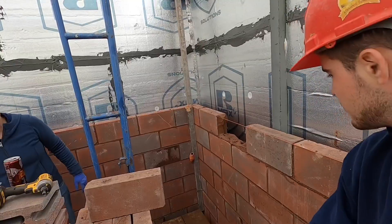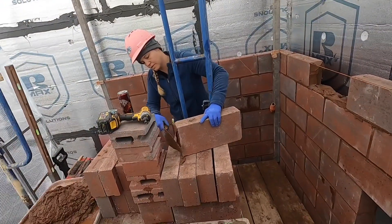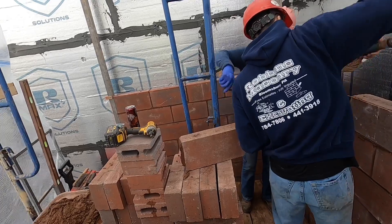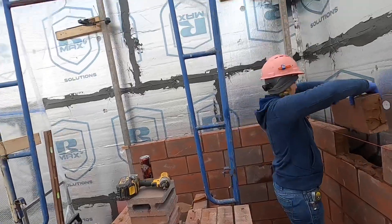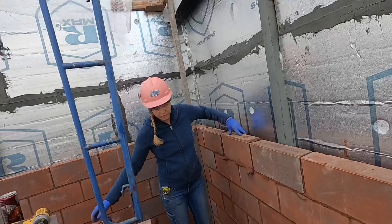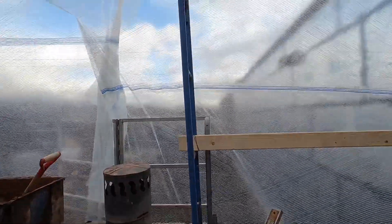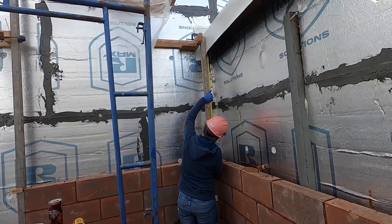Every time you have a closure, okay, you gotta head both sides of that block. And I lay my block on the wall. It's winter time so this wind — that's why it's making the audio crap. Squeeze it in there, cut the mud away, boom. Also in the winter you gotta have heaters and tents.